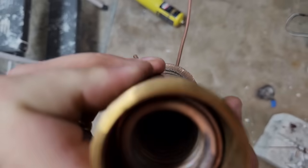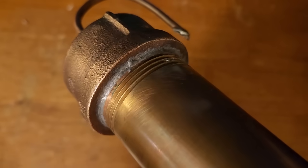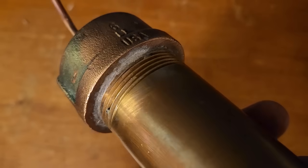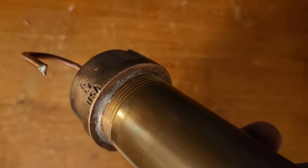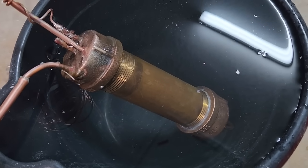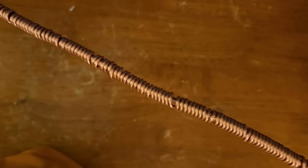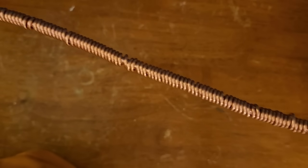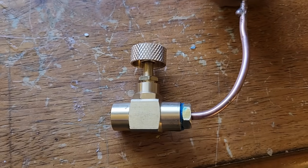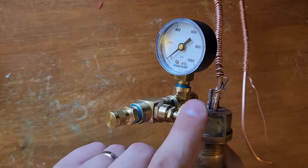Here's a look at that same evaporator crammed into the 1.5 inch pipe section. The edges of the fittings are soldered up to seal them — I used solder instead of brazing because it would make the fittings a lot easier to remove in case I had to fix something. No bubbles from the submerged pressure test at 300 psi. Additional capillary tubing is wrapped around the evaporator return line to maximize the subcooling effect and boost efficiency. A needle valve is then added to the drain line with a soldered-on brass fitting, and another valve with a pressure gauge and flare fitting is added to the fill port for the pipe. There's approximately 200cc of internal volume inside the pipe.